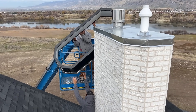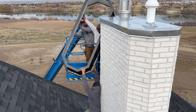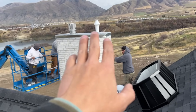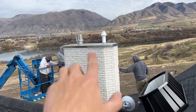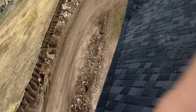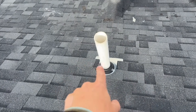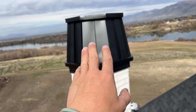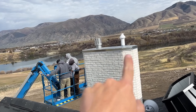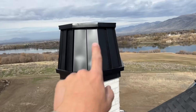Welcome to my roof, everybody, where we are finishing the last task for this roof for the year. This chimney cap is what is going to happen to that one. We have our galvanized piece on that is sealed and set — it is watertight like that. We could leave it, it would be just fine, but I want decorative. In this house, I went well out of my way to hide all of my utilities. Anything coming out of the roof I didn't want visible. These chimneys are visible, so I wanted to run our actual chimneys and all of our furnace venting out of them, and because of that we're putting this decorative panel on top.